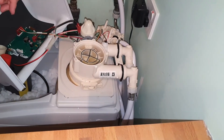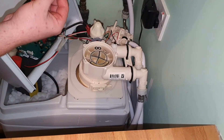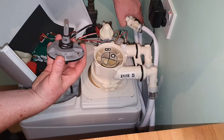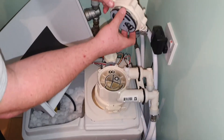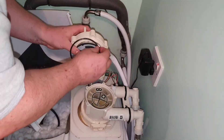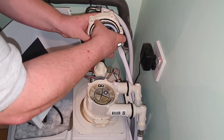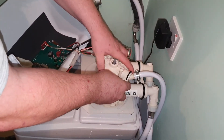Starting with the spider gasket and the wearing strip. Pop the figure-of-eight gasket in and the plunger, making sure the spring is located underneath. Pop the tension spring on top of the disc and just feed that through into the valve head. And lastly, put the main seal across the top — stretch it across and make sure it gives a good seal. Then carefully place it back in its position on top of the valve body.